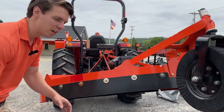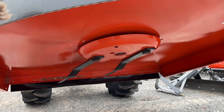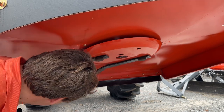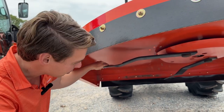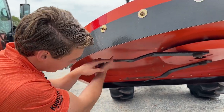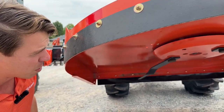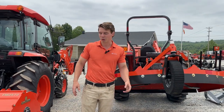If you look underneath a bush hog, it's very simple and very basic. There's not much going on under here. We've got this centerpiece called a stump jumper — so if you hit a stump, it's going to push the whole bush hog up and over it so it doesn't damage it, and it also protects your gearbox shaft. Then you have two very large, simple, heavy duty blades. These are very dull on the ends — designed to whack through material. It's going to hit that sapling, that tall grass, that brush, that briar. It's going to knock it down or cut it off at the base. It's not designed for fine grass or finish mowing. Two simple, basic heavy duty blades just sitting there spinning. Not much to go wrong, and it's very affordable.